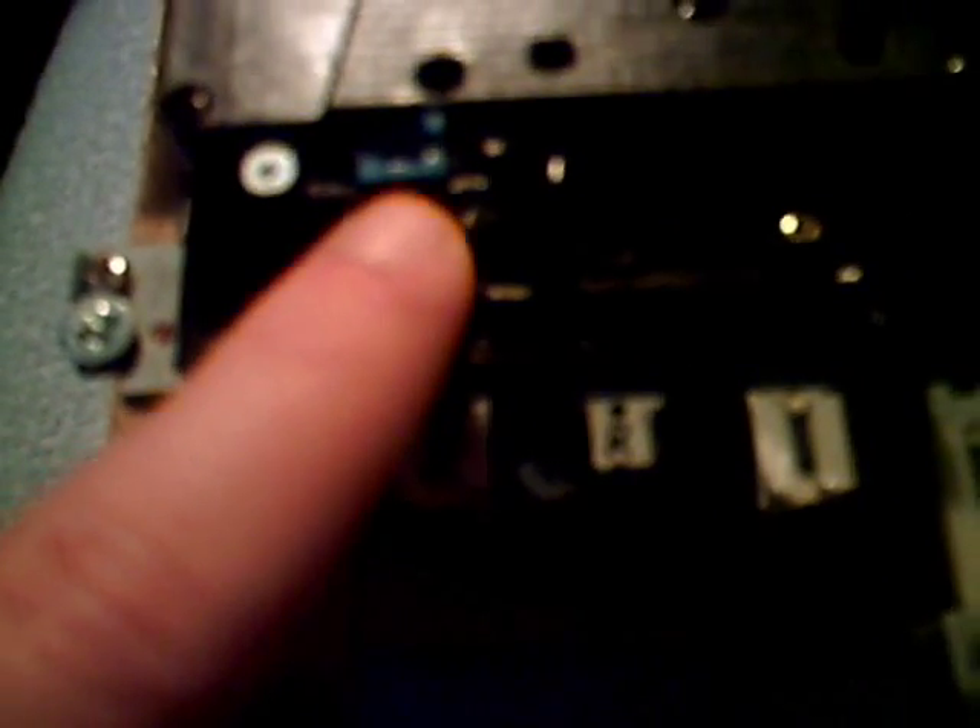Put in the cassette, then press the R button and hold it in place, and then press the erase button. Then plug in the power. The cassette is erased in the reverse mode — it is rewinding, and while it rewinds, the erase head erases the cassette.